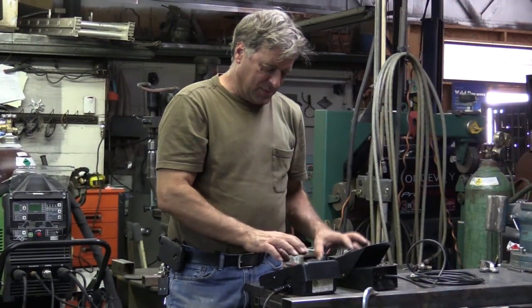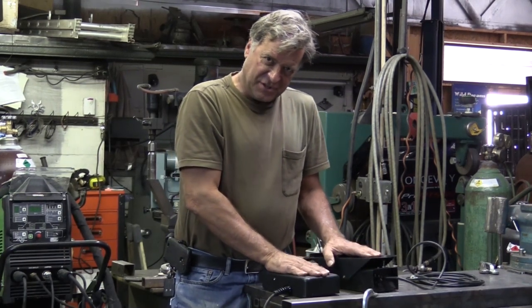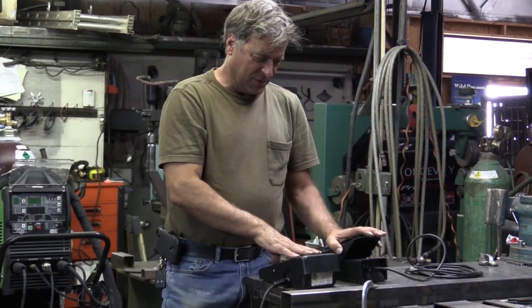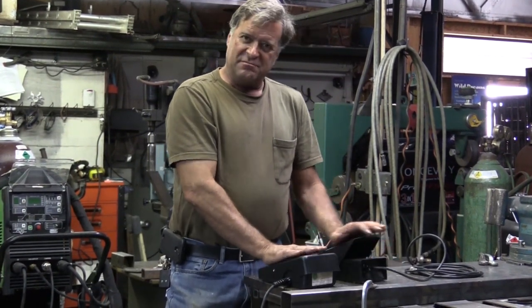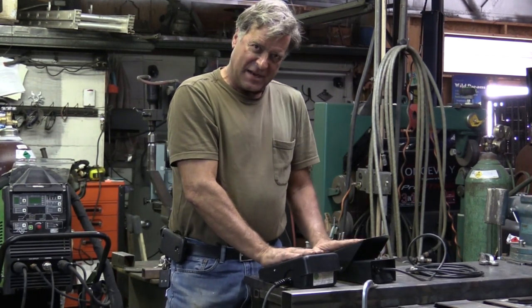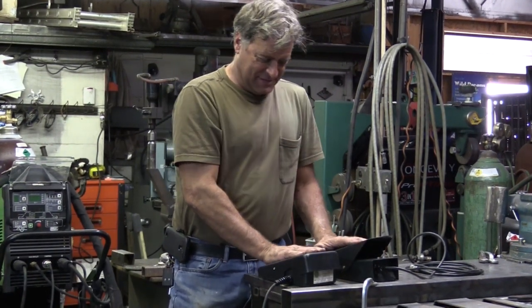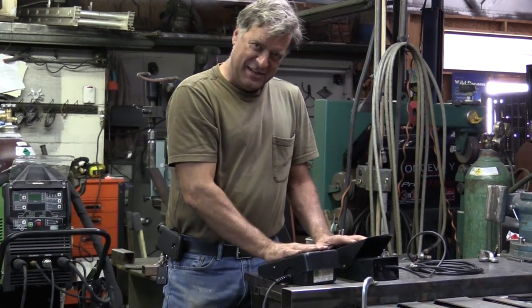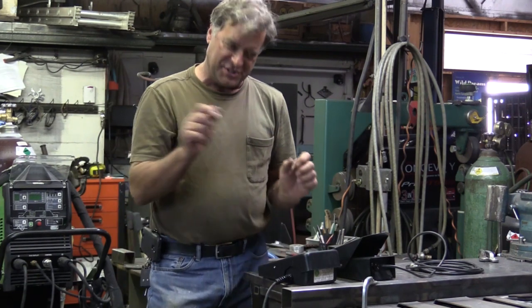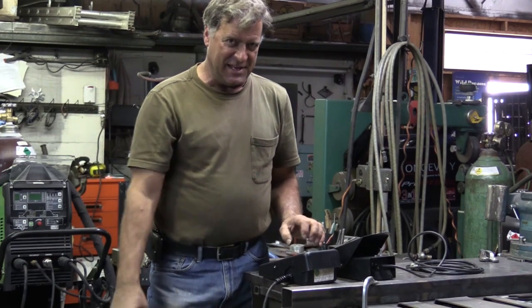One of the cool things with the SSC pedal is a lot less spring tension, even though it's got a shorter pedal than the stock one. It feels like about half of the spring tension of the stock pedal. You can just barely even get that one to bend with your hand. A lot easier on your ankle, especially when you're sitting there all day trying to pulse with it — welding all day. It's going to save the old ankle.